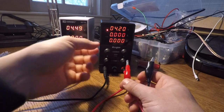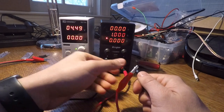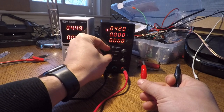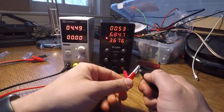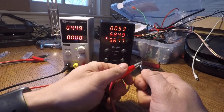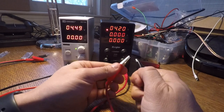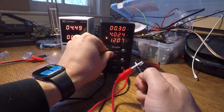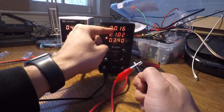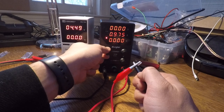This is the amperage knob. Why don't I move the amperage way up? Remember the amperage was set to one amp. Let's disconnect this. I can't see amperage right now — maybe this isn't having any effect. Well, let's connect them again. It did have an effect. We went from a maximum of one amp to almost a maximum of seven amps. So even though I couldn't see it, I was adjusting the ceiling for amperage. Another thing to mention: this unit does show watts, but that's just voltage and current multiplied — not particularly helpful.